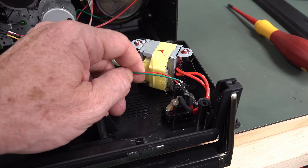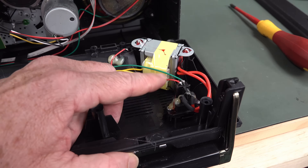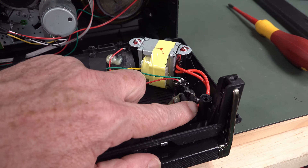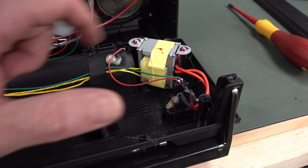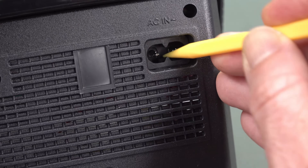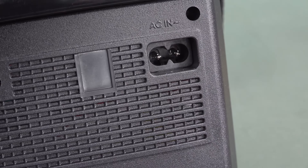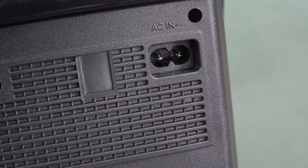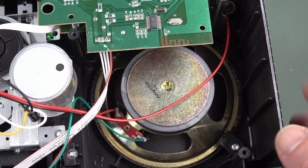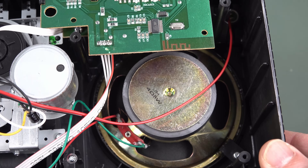What's going on here — is that a micro switch? When you plug in the mains connector — this is your mains output which goes straight into your transformer — there's a switch down in there that pushes down. So when you plug in the figure-eight mains flex, it disconnects the battery. Nice.